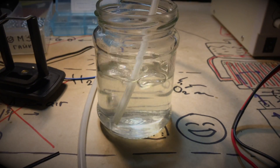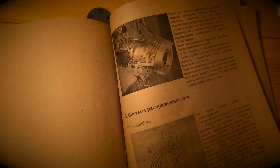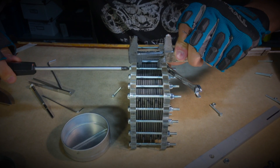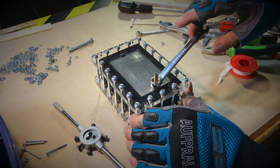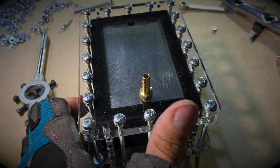Now we know the gas generation rate at any given time. Number 3: pneumatic fittings with clamps. Those who read my PDF instructions properly see the word 'tightness' every night. Tightness is the main thing in gas units — moreover, the tightness of the entire circuit, not just the electrolyzer. So all connections must withstand the same pressure.